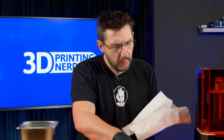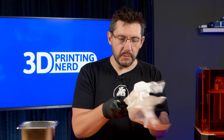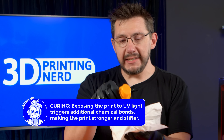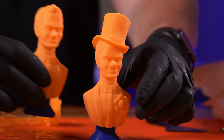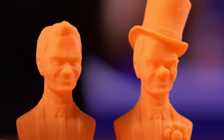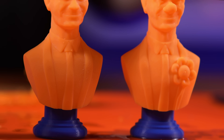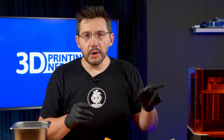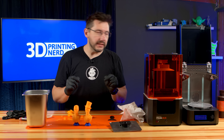I'm going to consider these both washed. Usually you can use a compressor or blow dryer to run air across the models to get the isopropyl alcohol off — you want to clear as much off the surface as you can before you cure it. For us, a paper towel is going to do just fine. When you have a highly detailed model, air is better. Here's where the bases come in — if I put a base on the bottom, now you can see what we're going for. These were scaled to 50% size so I could get both on the SL1S build plate. I'm going to reboot the CW1S and then initiate a cure. Having these bases means they can sit upright as they spin, so I don't have to brace them or cure them with supports.